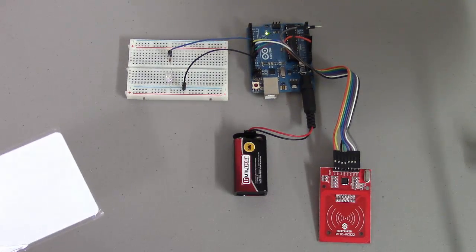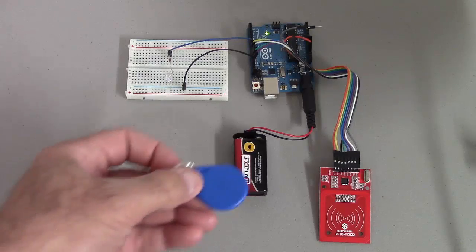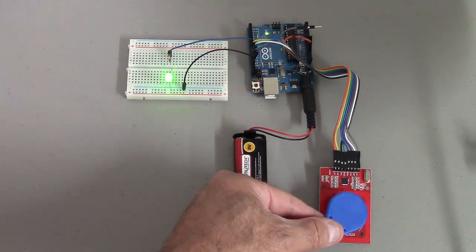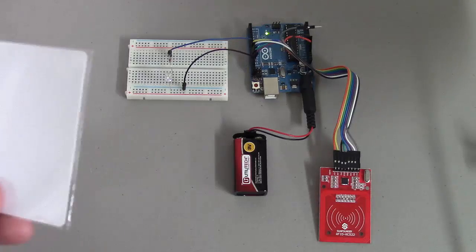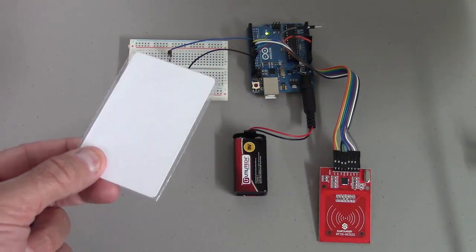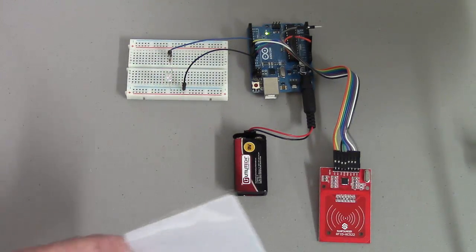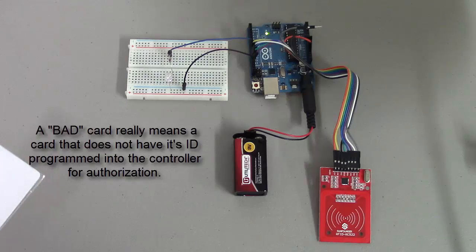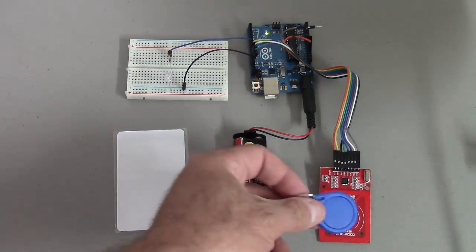The way this code works — and I'll show you the code in a minute — is it allows you to identify an RFID tag. I've currently got the unit programmed to identify this particular tag, so when I get it close, the LED stays on for about a second and goes back out. If it detects a bad card or a bad RFID tag, then it blinks. You could have it do any number of things — have a red LED come on instead of blinking the green LED really fast when it detects the wrong card.